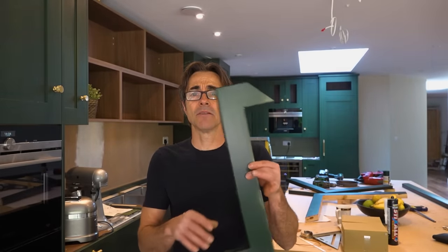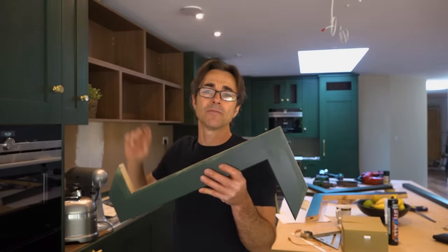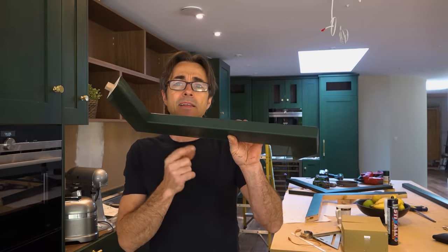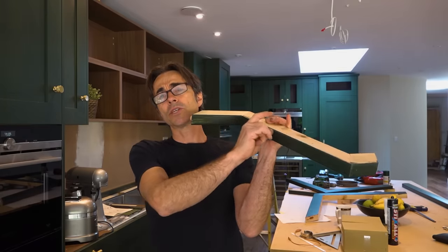So what I'm doing is forming - this is just one section of it - it's a cornice effectively. But because this is quite a modern contemporary kitchen, all we've got is a nice square edge and a round over, and then we've got a very simple mould which goes above that to the ceiling which will go on afterwards. That will be an MDF moulding as well, pinned to the ceiling and to this face afterwards.